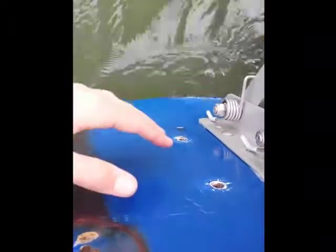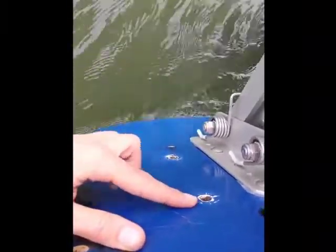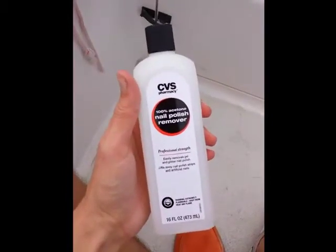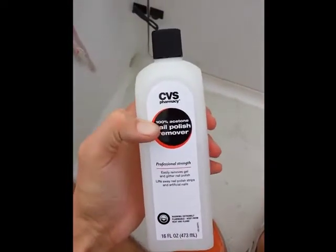Here I'm going to show the two holes we already had pre-drilled. I took the drill bit and removed all the old silicone, roughed it up with some sandpaper, and then used acetone to clean out the rest of the residue. You can get this at any CVS, Walgreens, any of those stores — make sure it is 100% acetone, as that's going to break down the old silicone.